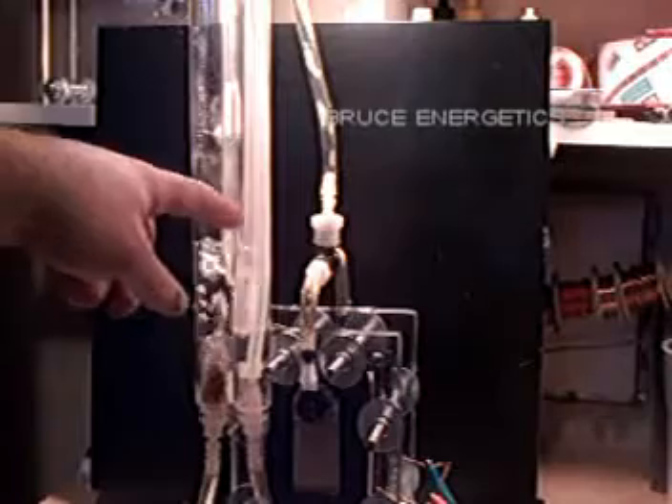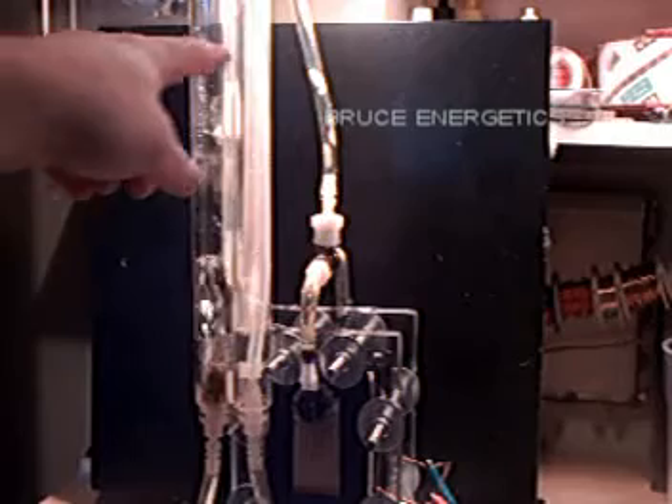We purged the cell so much that there's not that much foam left. When we first ran this thing it was cranking out foam, and this column didn't fill up with foam but it filled up with the water that was added to it. Eventually I had to change it — it was a bit of a pain, so I'm going to have to design a fill tube and a little drain valve or something in there. Now you see the foam dropping.